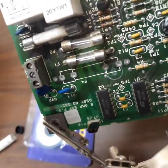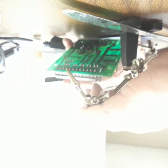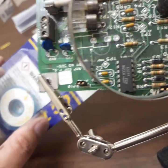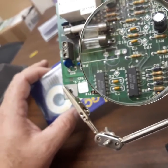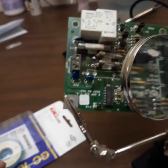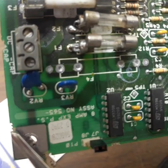Let me see if I can get it focused. I'm going to put some white behind it so you can see — see that? Where it blew the solder out, see that white coming? So I'm going to have to build that up a little bit. One of the technicians blew the fuse — he cut the 24 volts on a duct detector and it blew it. You can see the center core string right there, where they used flux or probably rosin core.